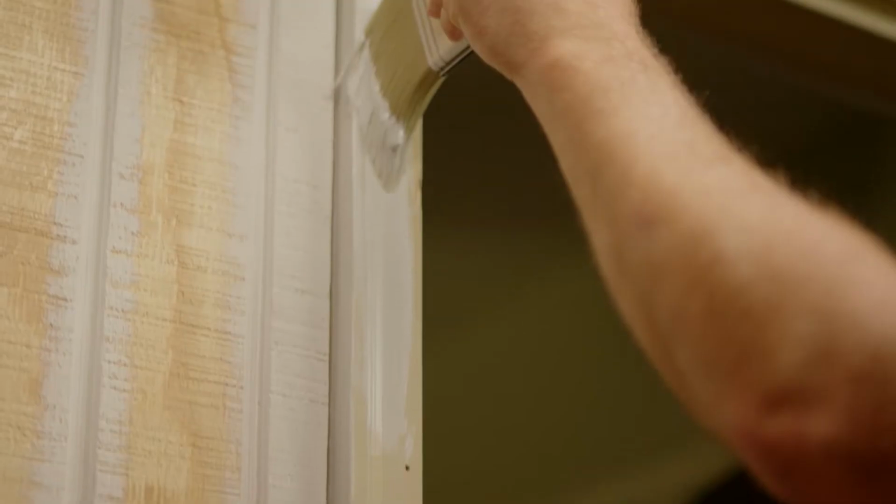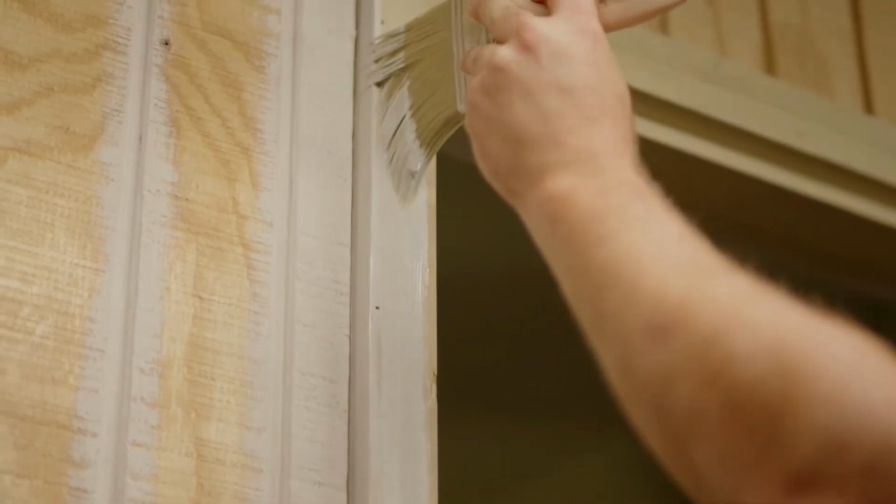I like to use water-based primers anywhere we can, especially inside. No one likes to have oil-based primers being used in their homes. A lot of the repaints that we do, the trim is oil-based. It's been painted years ago. Instead of going back with an oil-based paint or primer, we want to convert it to water-based. So if it's painted and you don't have to worry about any tannins bleeding through, we like to use a water-based primer to create a bond coat between that and our water-based enamel, whatever it may be. So essentially we're converting the entire house now into water-based trim, and we're not having to use any oil-based products to disturb the clients.